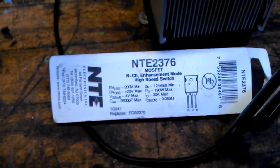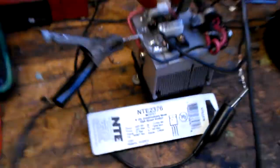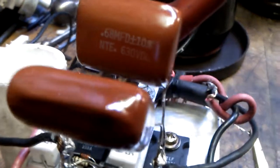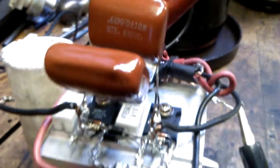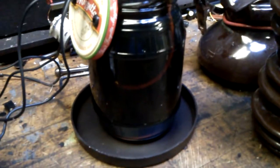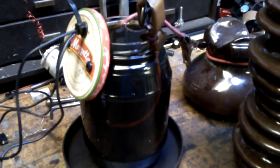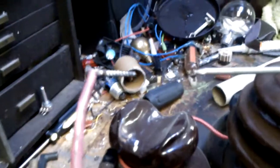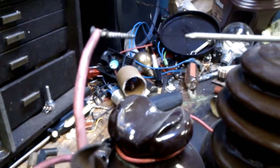Here we go, power on — 23.76 volts. All the caps I got today are 0.68 microfarad with two in parallel. I believe this has 5.5 turns on the coil, or it might be 4 plus 4. The gap is set at about an inch and a quarter.